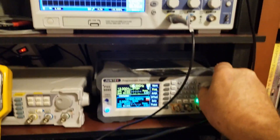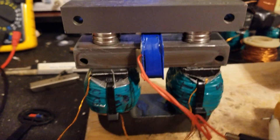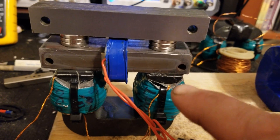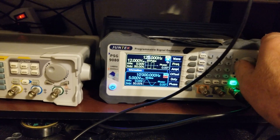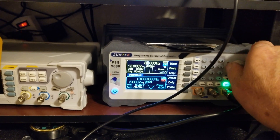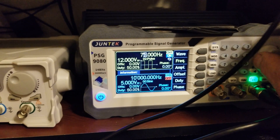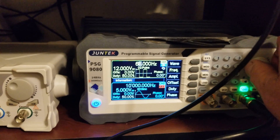The flux switching, after 120 Hz — at least with this core; with this one it might be different — but right now the way this is configured, after about 123 Hz or so, there is less flux being switched and it's more like a transformer. 80 is not bad, 60 is great. Real solid flux switching, and probably where I'd end up running the thing.